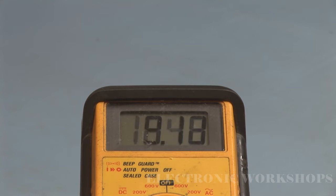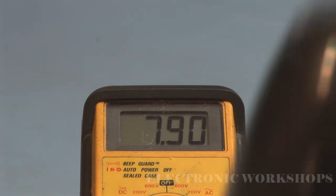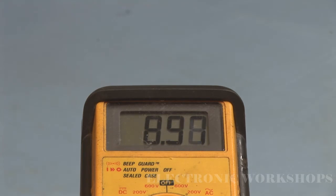You can see there our 12 volt supply is varying madly. So another little test I'm going to do is I'm going to heat this up using a hair dryer and see if that gets the power supply up and working, because the temperatures are very cold and it could be a capacitor problem. This will test it out — I'll just turn on this hair dryer and warm up the power supply.